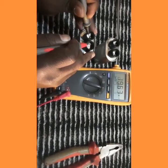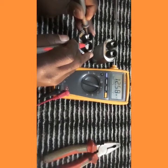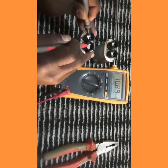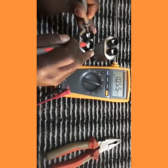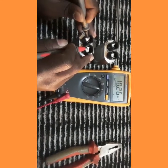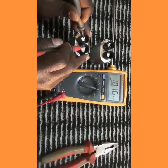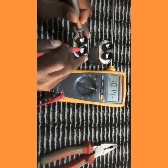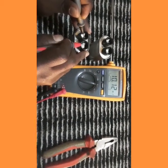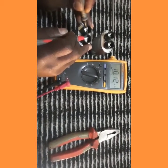Let's see if we're going to reach our 10 megaohms, which would show that the capacitor is fine. We can even have 9 megaohms because there is always tolerance on the values, so even 9.something megaohms is still okay. We are at 10 megaohms already — 10.1, 10.16, 10.17, 10.13 megaohms — showing that the capacitor is good.